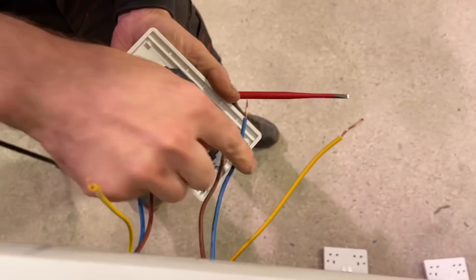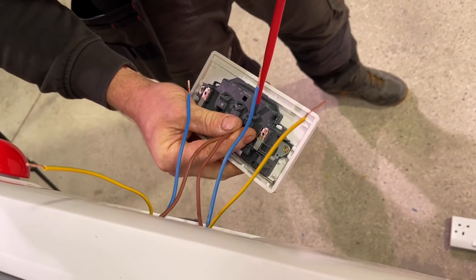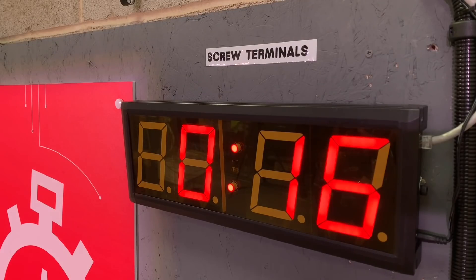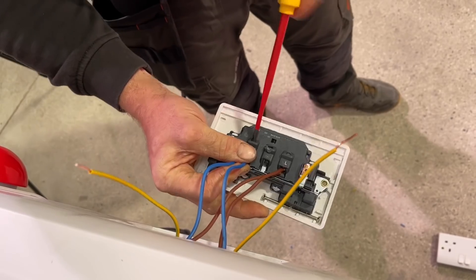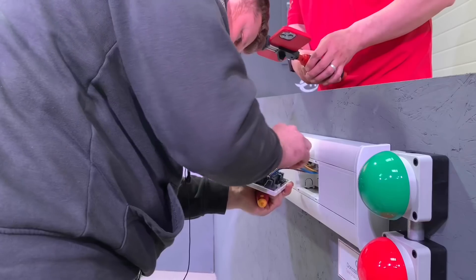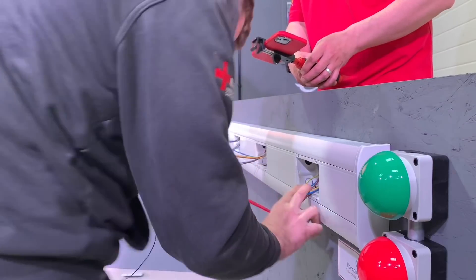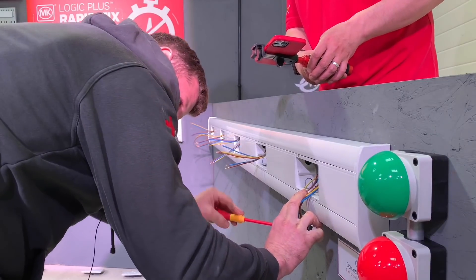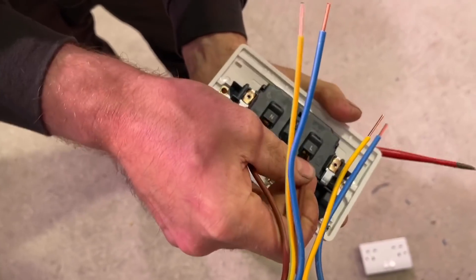Swinging into the commentary box, it's the Indiana Jones of the electrical industry. Let me start by explaining the challenge: we have pre-stripped those 2.5mm solid conductors in the dado rail trunking, and all Ross has to do is connect them to the screw terminals in the first half of this challenge and the screwless ones in the second half. We don't have to screw the socket back to the dado trunking, so we are literally comparing the time it takes to connect screw terminals versus screwless terminals. We've removed any variables — the stripping variable, putting the front back on — it could be the case you drop a screw, so it isn't a direct like-for-like otherwise.